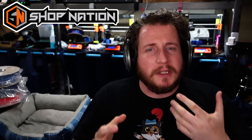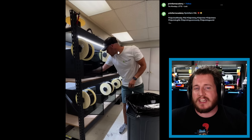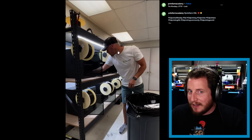For those who don't know, Print Farm Academy is also the Shop Nation people — they do a lot of 3D printing in-house to produce components they sell online. This is a huge issue from a waste perspective: time, material, all this extra stuff to get rid of because a simple check wasn't done. Being Bambu, they're likely using cloud integration, but remember — if you're using NDA stuff, don't trust the cloud, because the cloud is just somebody else's computer and your NDAs can get violated. They likely didn't do the material check or had it set wrong in the slicer. On the X1, if you don't have the right filament loaded for what's sliced, it yells at you. I don't have experience with the P1S, so let me know if it's different there.